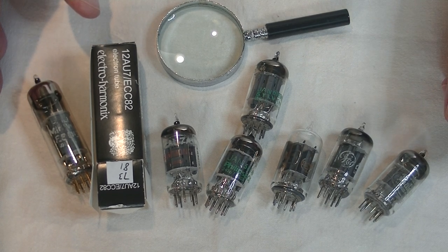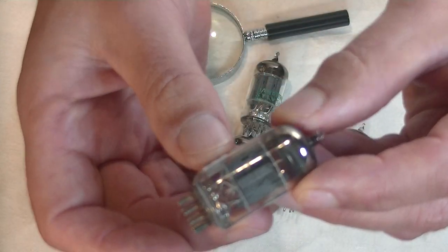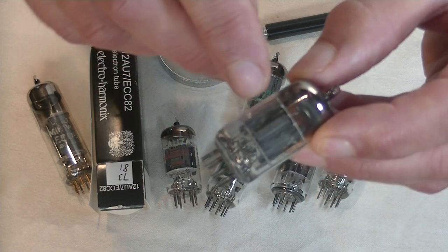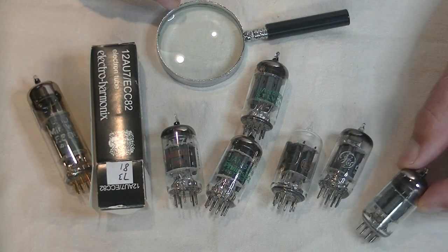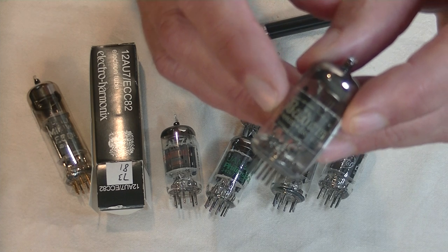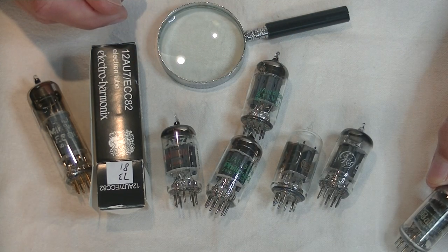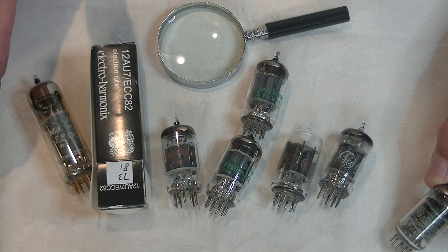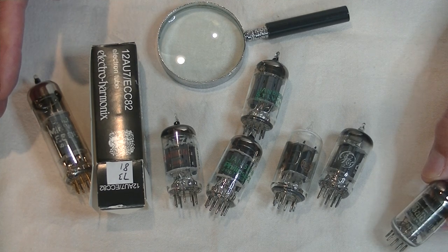Up first, let's take a look at my number 104, the GE 12AU7 grey T-plate version. You can see the bump in the middle — I would call that a T-plate. I use the shape, color, size of the plate, and the slots to identify tubes in inventory. These are labeled Baldwin Organ, making them an organ select grade tube, since tube organs use a large number of 12AU7s and required quiet tubes. This tube has very nice bass, good mid-range, and a crisp high-end, nice definition and dynamics, medium-level microphonics. Overall, a nice tube and affordable.